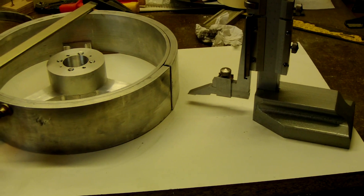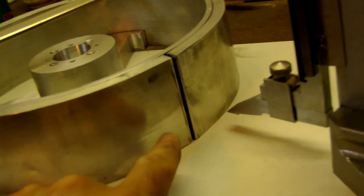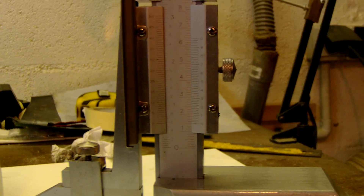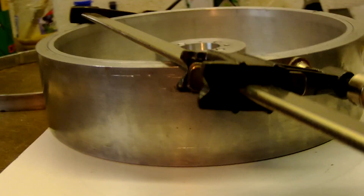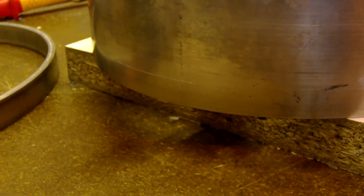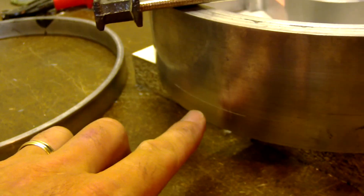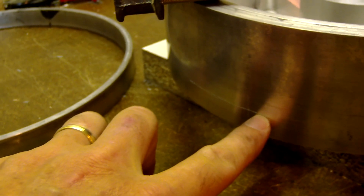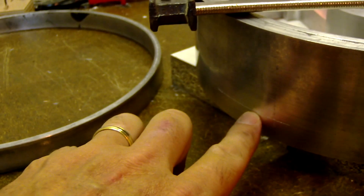For accurate drilling we need to be sure the height is very good and consistent. I use a height gauge — a precision hard gauge — to set the correct height, then trace a mark on the part. I do the same for the remaining side of the hub, and you can see the trace there. Then I just have to figure out where the center of the bracket is, center punch the two drill points, and it becomes a simple drilling operation.